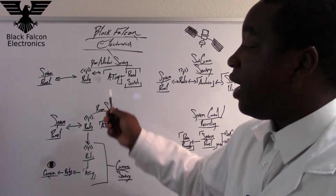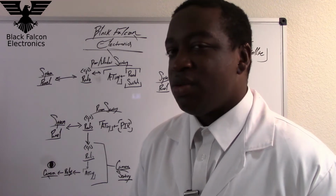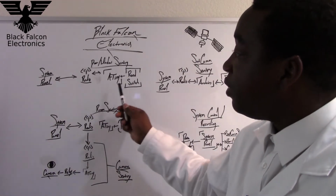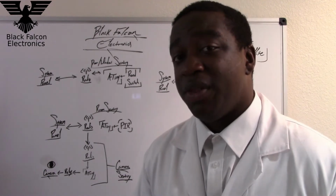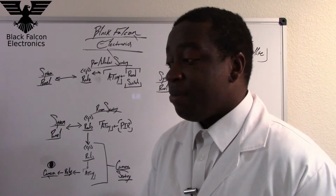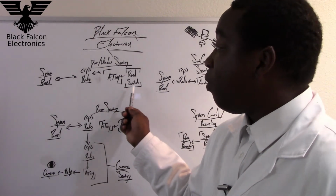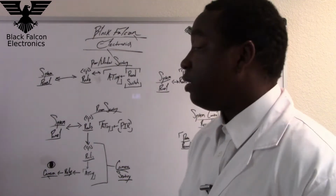So the ATtiny is a very small microcontroller. It's kind of similar to the Arduino in that it is a microcontroller, but it has very limited function. So I decided to use the ATtiny because it is so small and relatively cheaper than using an Arduino microcontroller, because it has to do very little. The libraries it can support are very little, but for what I need it for, just detecting if something is open or closed, it is absolutely perfect.